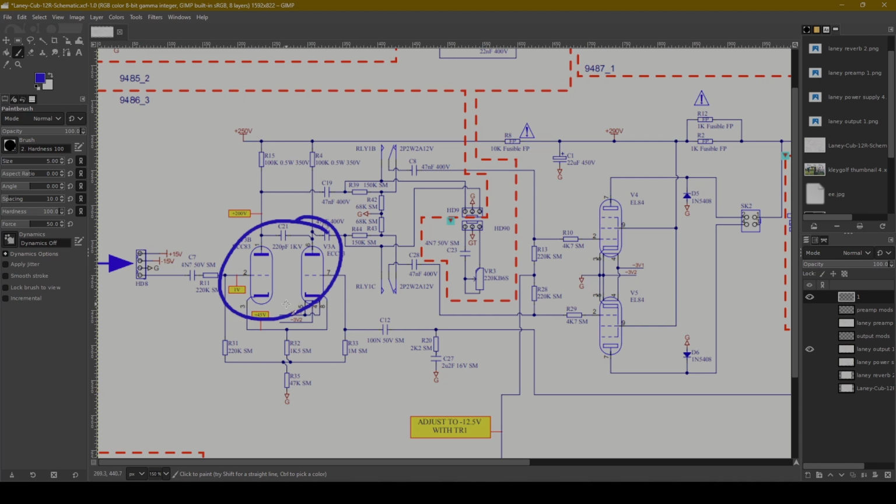Our 12AX7 is split into two triodes. Our audio signal comes in, goes into this first gain stage, and then takes this capacitor here towards the output tube. Then the grid is fed here through these resistors to this other output, or the other side of this triode goes up through this cathode into here. All this is just a very straightforward long tail pair phase inverter.